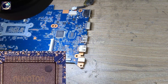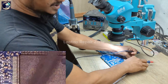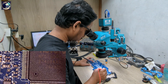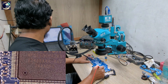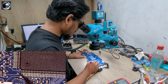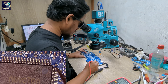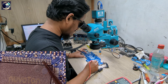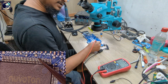Let's look under my microscope. I'll connect the power supply again and set my multimeter to DC mode. I need to check pin number 73. Here is pin number 1, pin number 32, pin number 64 — then 65, 66, 67, 68, 69, 70, 71, 72, 73 — it reads 0.35 volts.